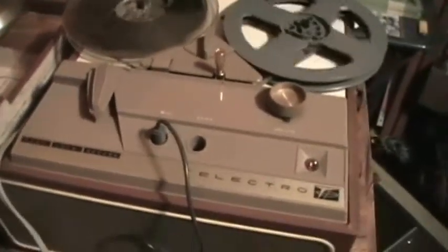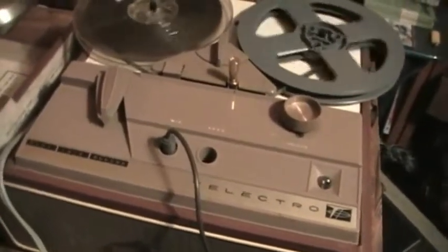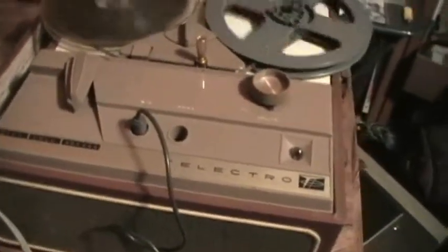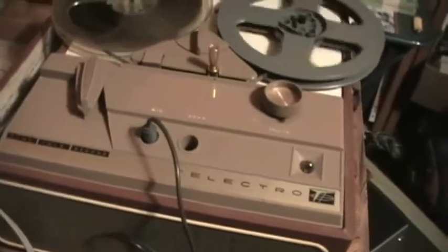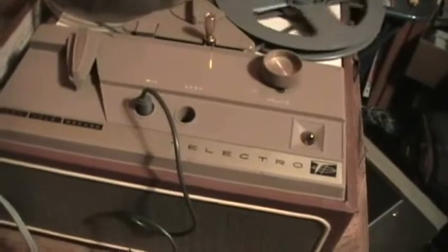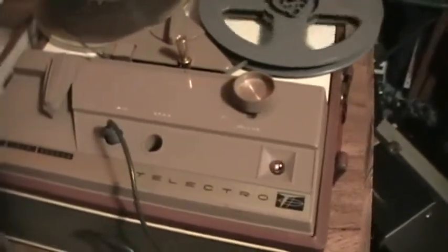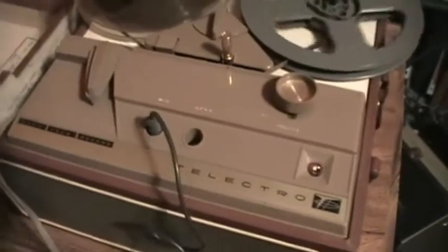It's an interesting recorder, looks pretty cool, but I wish it would have performed better. I wish the amplifier was louder and that the quality had a better high end, you know, the treble, and also didn't have the hum distortion. They should have put a better circuit into this recorder, and they should have used a power transformer to separate the thing from the AC line.